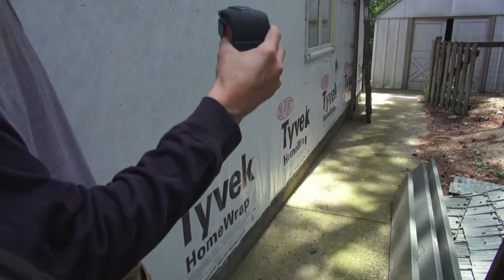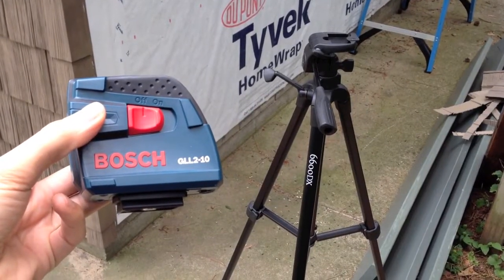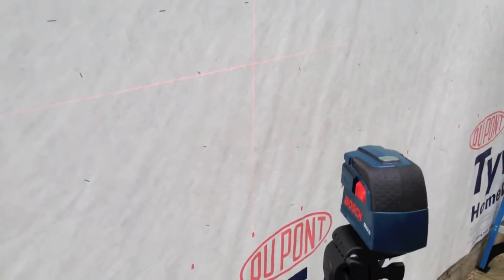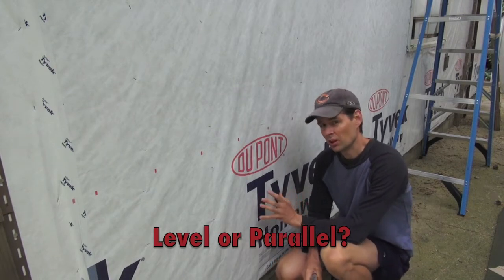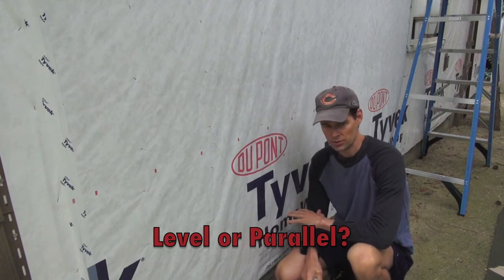You can go all the way around the house and end up at the same place you started — it's just the absolute height that matters. The laser level fits on any normal camera tripod, and the level spray covers about 15 feet to the left and 15 feet to the right. They say that when you do a project like siding, you should install it level and not parallel with the sloping house.